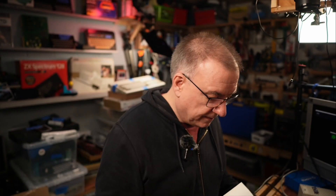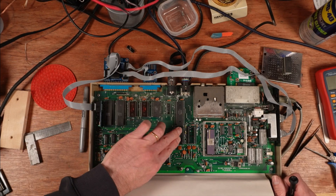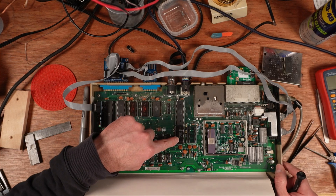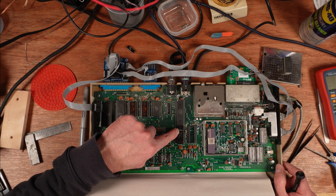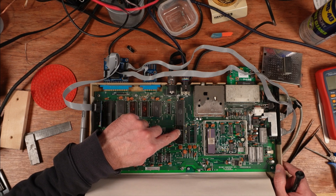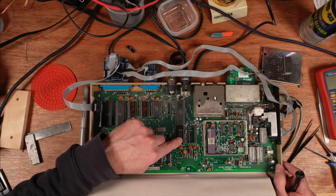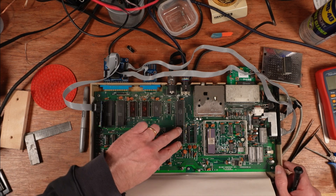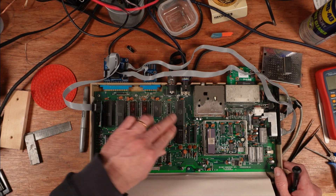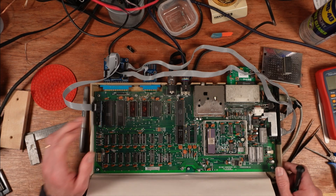There's still no output, so the first thing I thought of was the PLA. I took it out and tested it in my machine. This is one I haven't seen before — made in Singapore, no brand on it, just says '64 C64A' and '93459 PC F8240'. It's dated late '82, which is a nice early PLA and must be one of the first batch. It works fine, which is really nice.